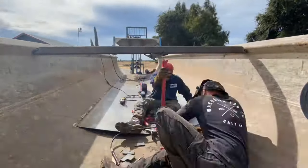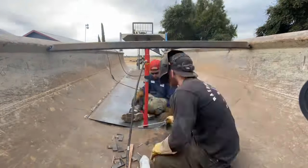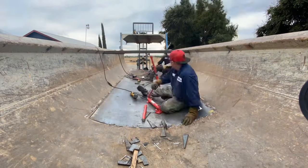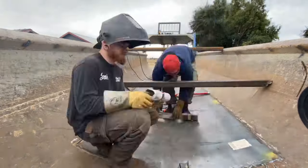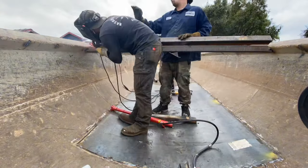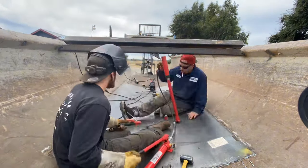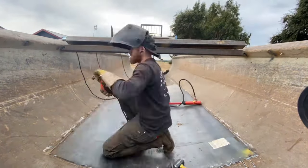As you can see this is a 3x3 quarter-inch piece of square tubing and we're getting it to bow pretty far. We also plasma cut a few holes in the center of this plate to hold it sucked down, so that's what we're doing here — trying to get all those holes fully smashed down. Once they're as flat as possible you can plug weld them. It was bowing a little too much and getting kind of sketchy, so I took another piece of that 3x3 quarter-inch tubing and tacked it to the top at an angle — like a diamond shape — which is a little bit stronger and can bow less.